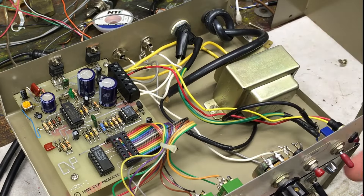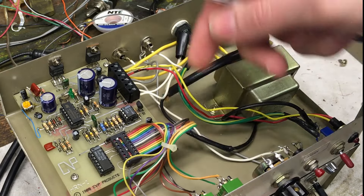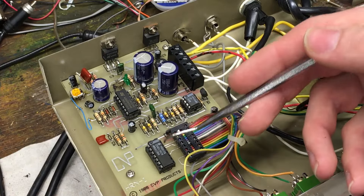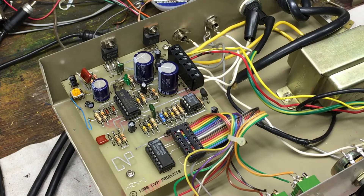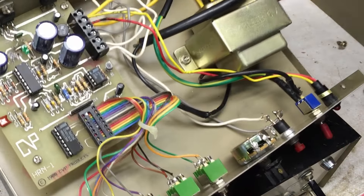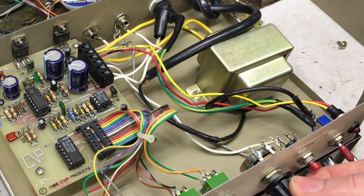We have the on/off switch, an indicator LED over here. Interestingly, all these little toggle switches are on a ribbon cable. Changing these integrated circuits would change the characteristics of the audio produced, because it's just a bunch of oscillators producing different tones. This knob does not go to anything — it is completely disconnected. Since these are kit project boxes, I'm not surprised it was doing something else at some point and just got left in.